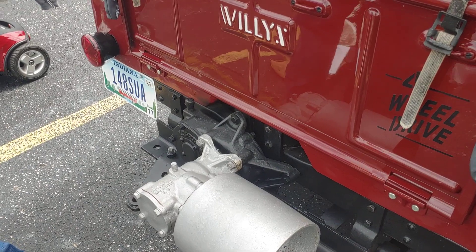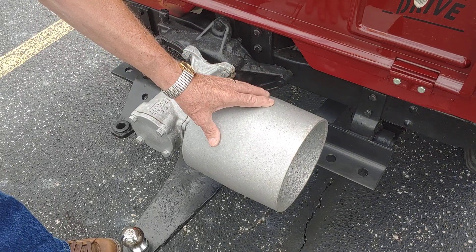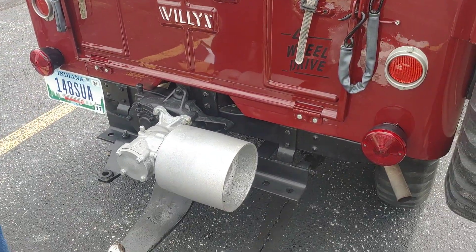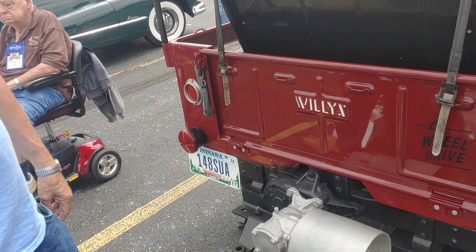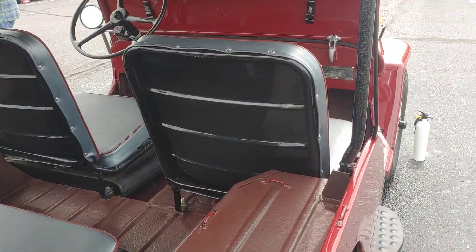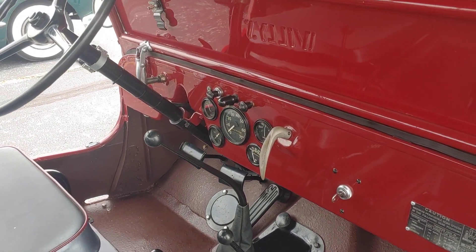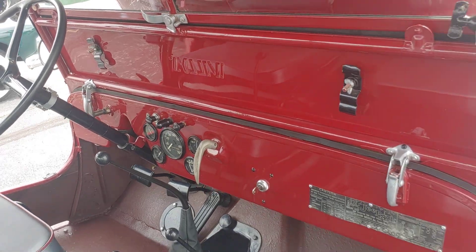You could also run a saw off of this. My uncle, when he purchased it, ran it on a threshing machine. That belt would be 60 feet — 30 feet from one side — and you had to twist it, because you had to put a twist in the middle or she'd run off to the side and run backwards. But you could run it backwards because once you shift the transfer case out and into neutral, you've got a direct drive back here, and you can reverse the threshing machine.